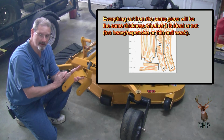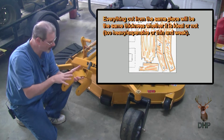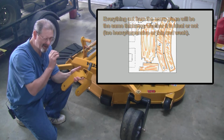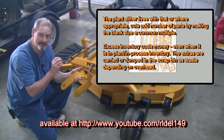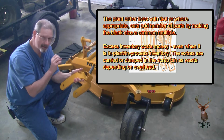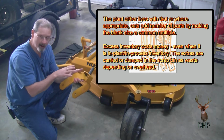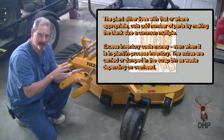And we have a process in manufacturing called shakeouts or cutout or nesting, where we take a given sheet of material, and whether it's maybe the perfect gauge or not, we may have some pieces a little thick, we may have some pieces a little thin, you know, but we're putting as many pieces as we can in a sheet. After it's come out of shear and decoil, we've cut it out, we've got multiple pieces in there, and now we're trying to cut down the waste.